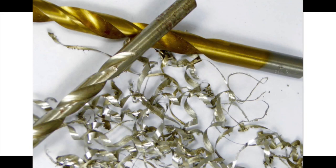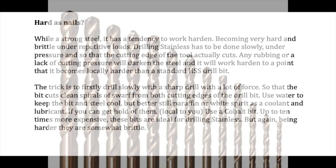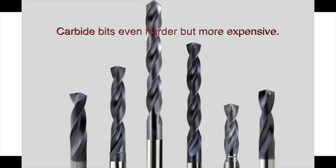While strong, stainless steel has a tendency to work harden — becoming very hard and brittle under repetitive loads. Drilling stainless steel must be done slowly under pressure so that the cutting edge actually cuts. Any rubbing or lack of cutting pressure will darken the steel, work hardening it to a point harder than a standard high-speed steel drill bit. Drill slowly with a sharp bit using lots of force to produce clean spirals of swarf. Use water or a water-based coolant, or better still paraffin or white spirit. Cobalt bits are ideal — up to 10 times more expensive but extremely hard, though somewhat brittle.